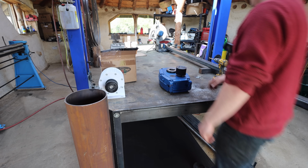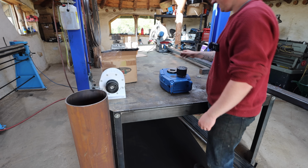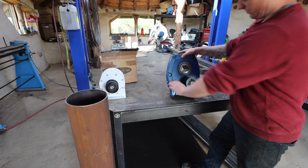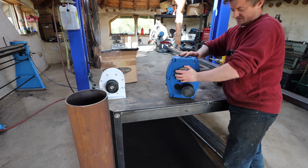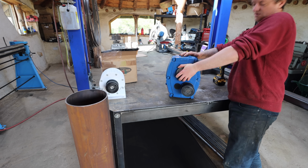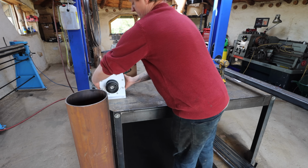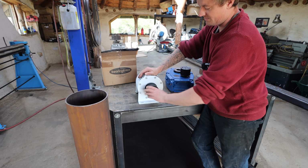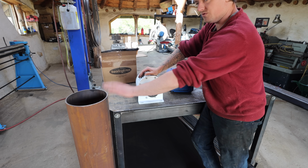First thing we're going to do is make the frame and the hub and get the gear reduction all working right. So we've got a 50-to-1 gear reduction here. The wheel's only going to be doing between 12 and 16 RPM depending on flow rate, so we've got to increase the speed. So that's our gear reduction, and then that's going to be powering a low RPM, 500 RPM, 2 kilowatt permanent magnet alternator. That's going to be driven from the hub, which is here.